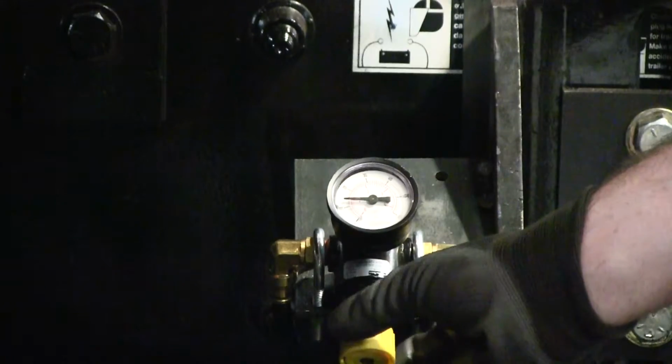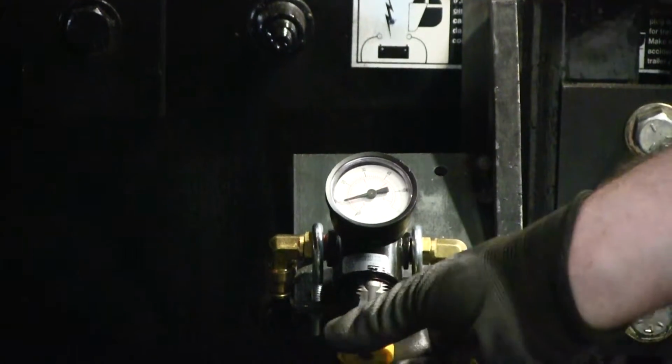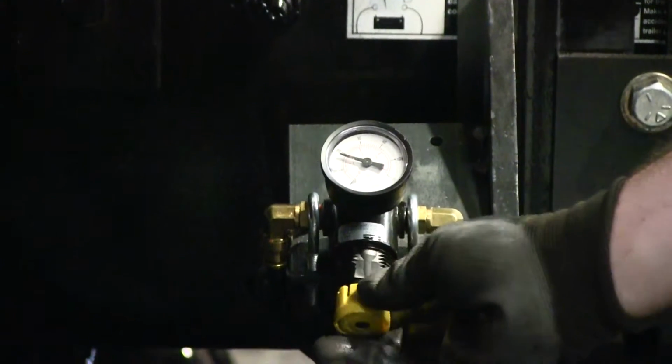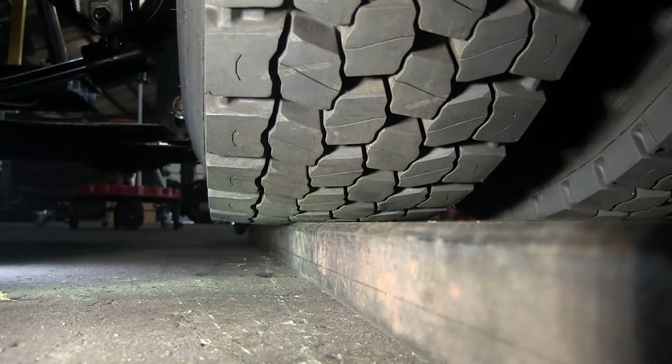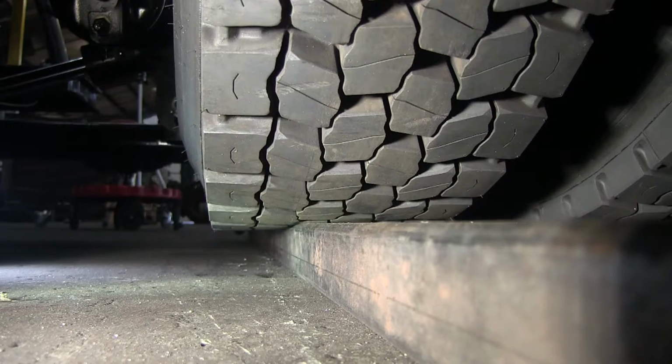Some trucks have air suspension for the rear axle. On those vehicles, the weight can typically be adjusted with an air regulator instead of shims. Visual inspection of the tire deflection can be used to adjust the rail gear load. Minimal tire deflection over the rail means the tires do not have enough load on them. Excessive tire deflection over the rail indicates that too much load is on the truck tires. Add or remove spacers from the rear rail gear as needed to achieve the correct tire deflection.